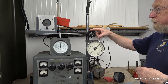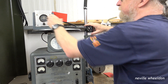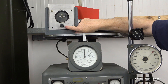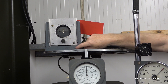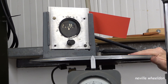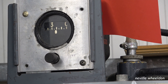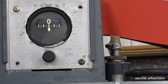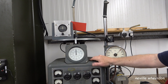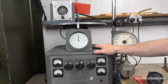We're using the force of the vacuum to suck air in, and the air coming in is making the gyros rotate at four inches of mercury — not that much of a vacuum, but enough to get the air to suck through. I'll uncage that now to run up. The direction indicator is not a compass per se — the pilot would set it and zero it to his desired heading, and it would then show if he's drifting off. As I rotate the table it stays geostationary, showing the aircraft is changing course. It's an easy identifier for the pilot.